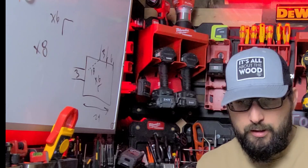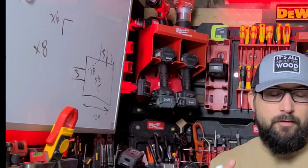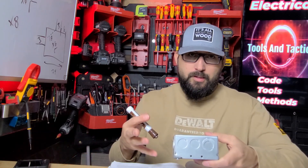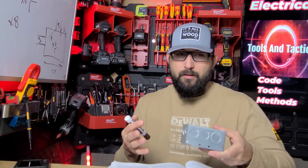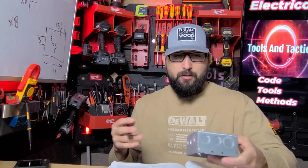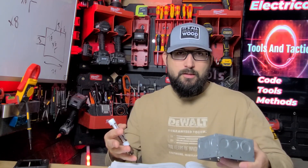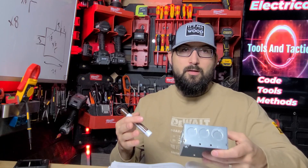Once you're sizing your boxes, you're looking at your conduit size and saying, 'My conduit size is only four-inch. If I enter this box here with four-inch conduit and come out here, I only need a 24-inch box — four times six is 24.' But remember, if you're going to enter the middle of the box, which you probably are, and leave the middle of the box, the installer needs to know they need to be at least 24 inches from entry to entry. You might want to get a 36-inch box — the proper size would be closer to a 30 to a 36-inch box.